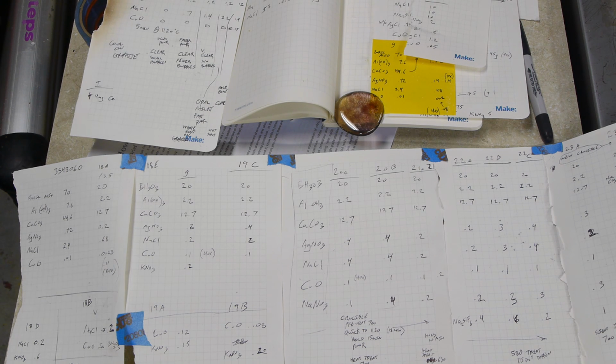I should also point out that a lot of the patents around photochromic glass talk about a lot of these times and temperatures, but they'll say things like, oh, the heat treatment may be conducted between 500 and 700 degrees C for between 10 minutes and 2 hours. Now, what will actually happen is that the heat treatment only works between 600 and 620 degrees, and it must be between 30 minutes and 40 minutes. But of course, they want the patent to be as broad as possible, and if there's some weird way you can make it work outside those parameters, then fine. But they're definitely not describing the easiest way to make it. They're describing all the possible ways to make it. And so that's kind of another problem with the patent system, is that you write them to be overly broad. But anyway, okay, let's get down to business here with the chemicals.